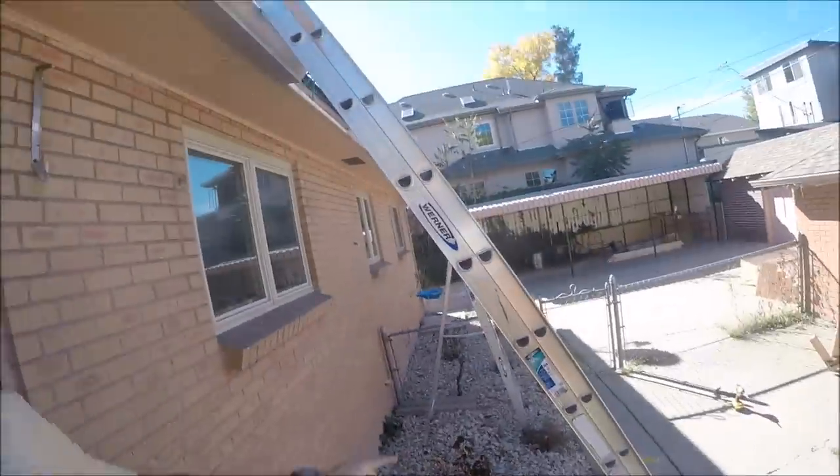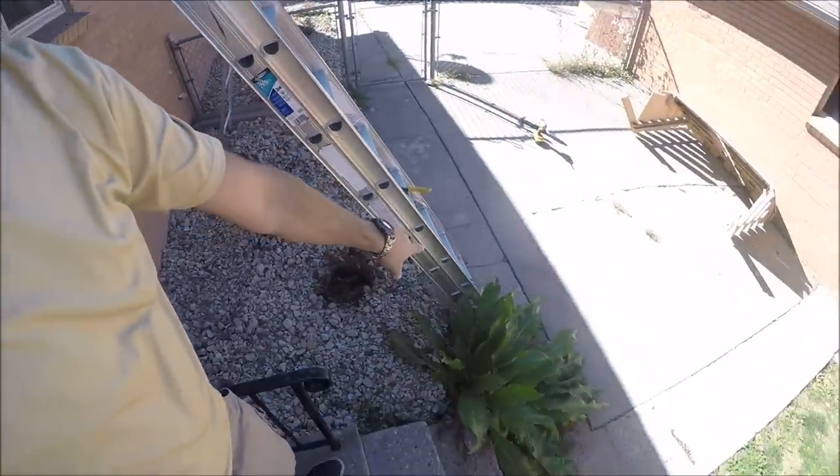I should not be using aluminum ladders. That's why you'll see electricians always have a wood or fiberglass ladder — their ladder is not grounded. The grounded ladder would be the path that electricity would travel, and if you're standing on it you could get zapped.